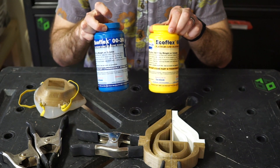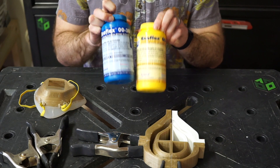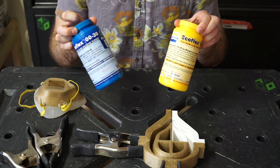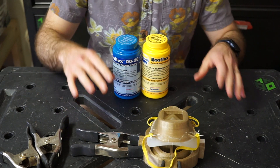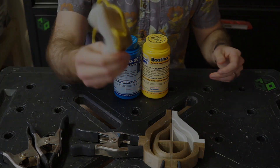This is a very common candle molding, food-safe, two-part silicone, so a lot of hobbyists and makers already have it. You can buy it on Amazon for $30, and this will probably get you four to five masks, maybe even more if you're careful about your pouring and mixing. You pour your silicone in, drop your mask in, and then top off with silicone. It takes four hours to cure, and then you just slide and pop it right out, and your mask is ready to go.